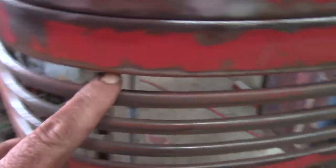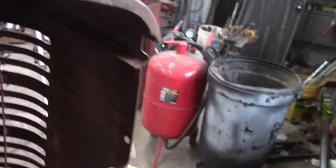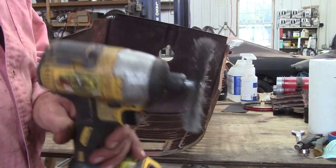Pretty much cleaned out all that scabby rust through here - all through all those areas. Now the tricky part: I've got to get on the back side. Look at it - it's all full of rust in there, surface rust all over the place. I think what I'm going to do is lay it on the bench and use that slower wire wheel, because I don't want to fight with that big thing. Maybe I can get on it with the sandpaper too.